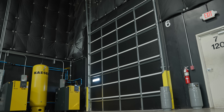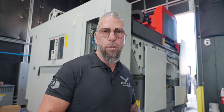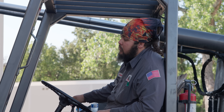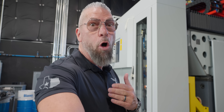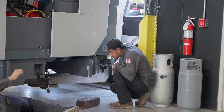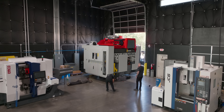When it comes to the bigger ones, the next stage up would be a 14-foot door. These are standards that you can easily get roll-up doors for. 13 feet — not so much — but a 14-foot door is a standard. A lot of these companies, when they go super big on monster machines — like 60 feet long — they'll keep the bases in pieces that can fit through a 14-foot door. So it's important to understand when you're building out a facility: if you know you're going to go big, make sure you have the proper door, otherwise you will not get machines into that building.